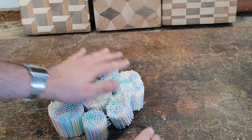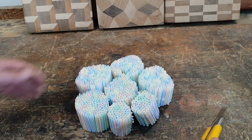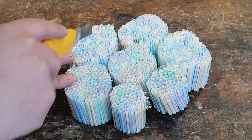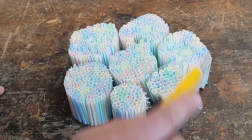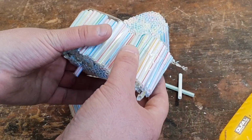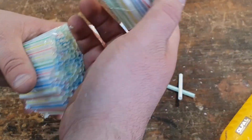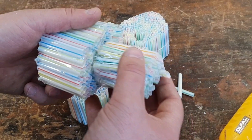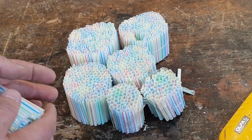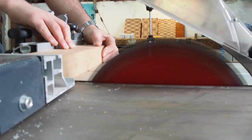So this is what you get, end grain upwards, and you obviously glue them all together as so, and the same properties that we discussed before will happen also here. And also the gluing is very strong, because gluing this way is much stronger than gluing this way, because when you put glue on this side, the grain would suck all the glue and it will be a very weak connection. So this would be the much preferred option for gluing.